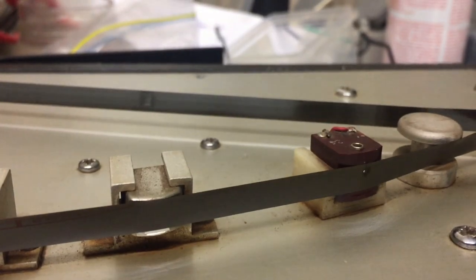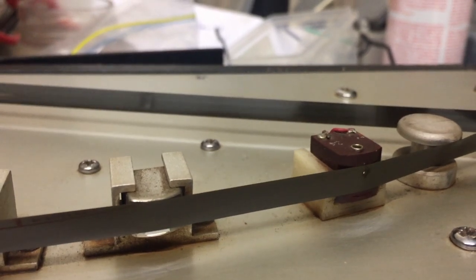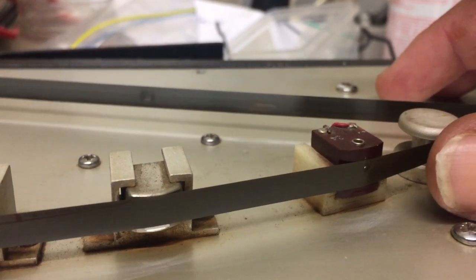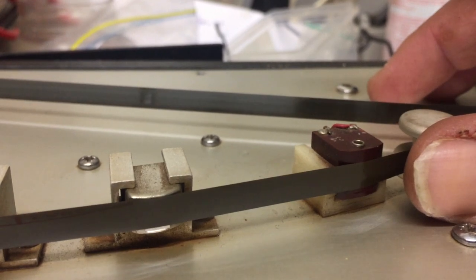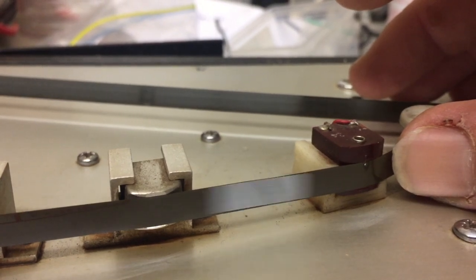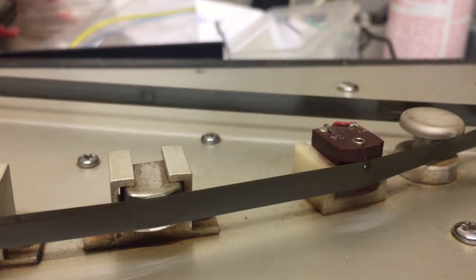Have the tape running for a few minutes and you have been playing on it, there's still this kind of trace of the sound. If you really want to erase it, you'll have to push the tape against the erase head, which is this one of course, and then you'll hear it gone.